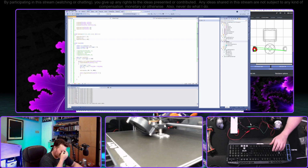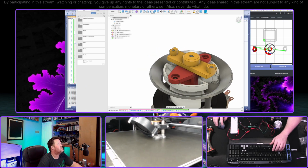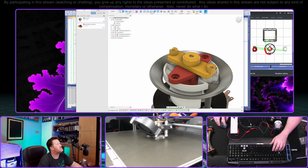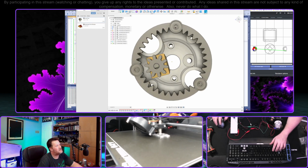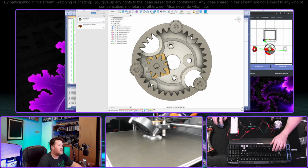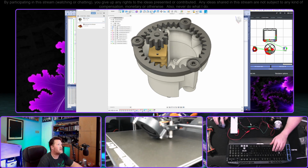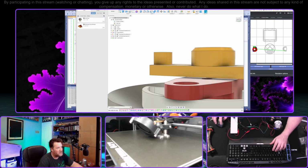The fact that this is kind of taking the spot of the lamp bothers me. I started going down the road of looking at how to maybe make enough space, and I'll open this and give you an idea. This adds just a smidge of complexity to the entire thing, but theoretically, it should be possible to move the motor this far over in the pop bumper. These are the holes that usually the wedge comes out of, so you could still put a light in here. But then I'd have to do this gearbox thing, have another gear here, put this on a race, and then connect that.